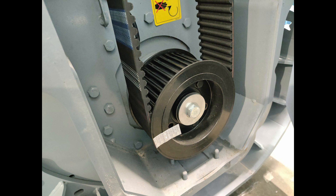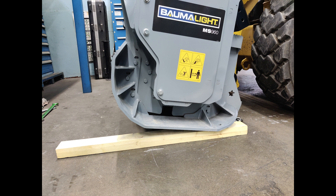First, open this cover, then apply some reflective tape to the bottom pulley since we want to calculate the rotor speed, and the top pulley speed would differ from the bottom. Also make sure to have some support under the skis of your mulcher to avoid the rotor hitting the ground while testing.